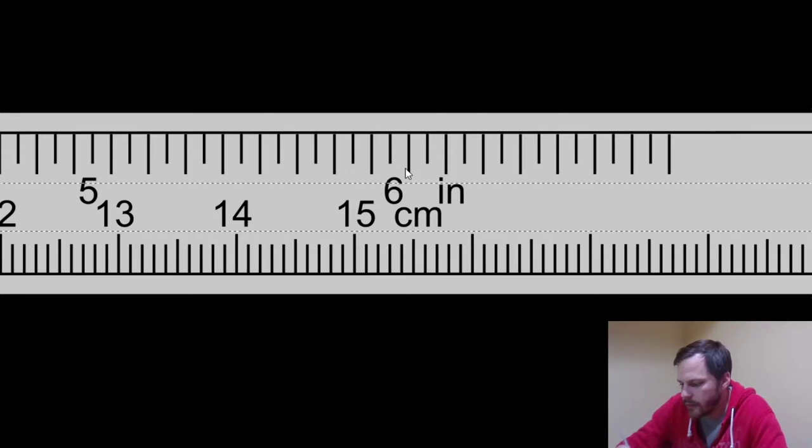The top is in inches — you can read 1, 2, 3, 4, 5, 6 inches. On the bottom you see 0 through 15 centimeters. Just like the ruler, those larger numbers are centimeters, and every little tiny mark along the way is millimeters. So 13 centimeters is 130 millimeters, then 131, 132, 133, 134, 135 — exact same as a ruler.